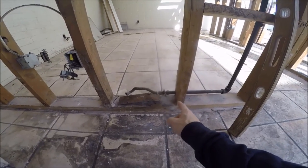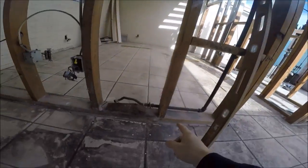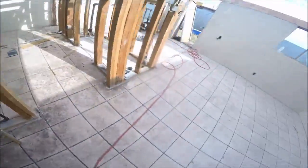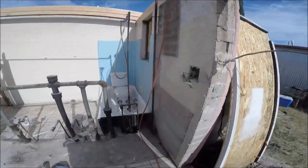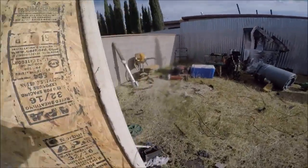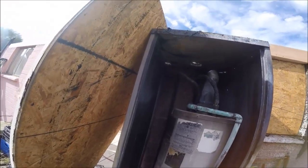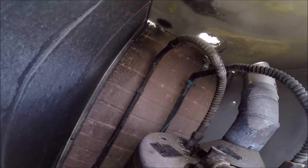There's a half-inch stub out here for a wall furnace — I can tell by the flue — so I'm going to cap that. There's a three-quarter line for a domestic gas range, I'll cap that too. You can see here's where the fire started somewhere — they say the water heater did it. It's all melted here, so maybe they had some hot flue piping touching combustible material.